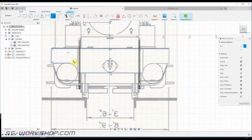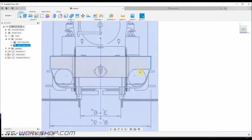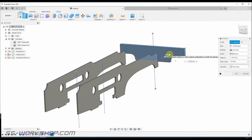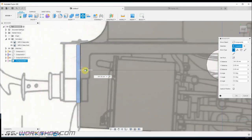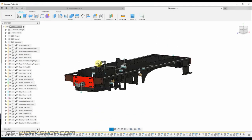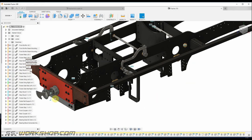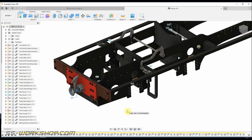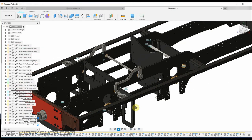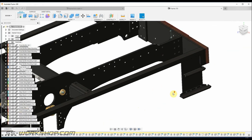From here we can draw more parts. You'll see I'm drawing the front buffer beam here, starting from the front view and tracing the outline. One thing you'll notice is that the 3D CAD is smart enough to know when you mirror a sketch from one side to the other — so when I adjust one side, the other side adjusts as well. From here, once again extrude the part and move it into its location. This process just continues to be repeated and refined until we're down to a detailed model. All the holes are drilled and there are even bolts in some of them. You can even animate simple moving parts to check that they work, like I have here with the coupler. From here all the mounting brackets and other hardware can be added to the frame so we can check clearances and make sure it all works. When something doesn't, it's just a matter of retracing your steps and altering the part.